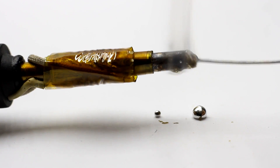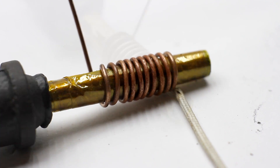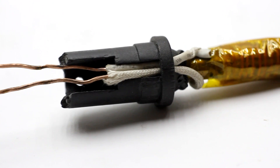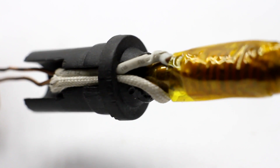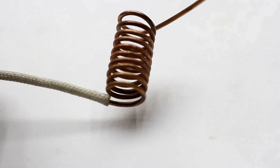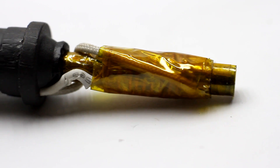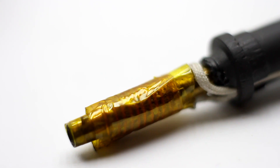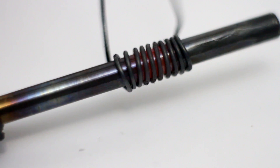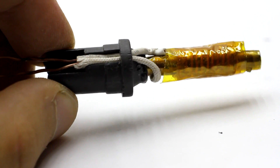A link to purchase can be found in the description. After winding, it is desirable to insulate the space between turns with the same adhesive tape, so that when the inductor deforms, accidental contact of the turns is prevented. Now we need to pull out the ends of the winding. I drill a hole in the base and through heat-resistant cambric, pull out the ends. On the inductor a casing of screening material must be put. In my device it isn't yet installed as it is a prototype. Using an iron screening sheet may cause efficiency loss since the inductor will partly heat it, so I'd advise using a brass or copper casing. On top of the inductor, put the same insulation tape again.